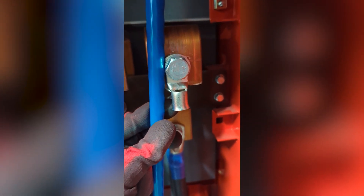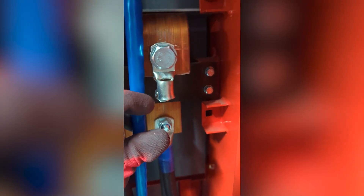You can obviously see the other one - that's how it looks. This is the inner sheathing so it's quite easy to take off, we can just do this the whole way down - makes it nice and simple. When we get to the end we'll just cut it and they're all ready to go. We'll tape the bottom of that there. What we normally like to do is give it a little kick or a little swan neck, bring it up to here, line it up with that lug, chop it, crimp it on and it's ready to go. For these ones we are using these lugs which are the 70-12s.